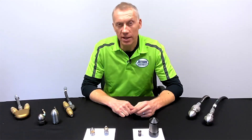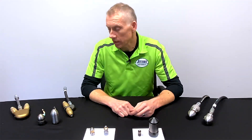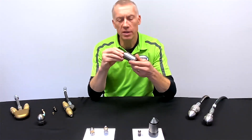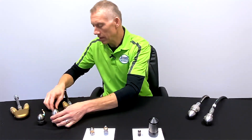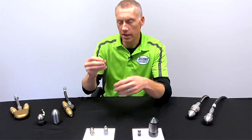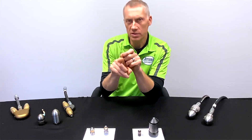The last type of rotating nozzle we're going to cover is the internal rotation nozzle. You've heard maybe some of these names: the Bora, the Rotodrill, the Root Ranger series, and the brand new, very effective Reaper. What makes these different? As you look at one of these, you don't see any rotating aspects on the outside — it's all happening internally. If you took it apart, you would see that the orifice shooting the water is on a rotor, with a seat in the front of the nozzle body so that as water hits the rotor, it swings it around. Coming out of the nozzle is where you see the rotation.